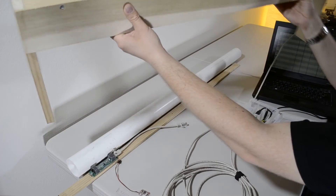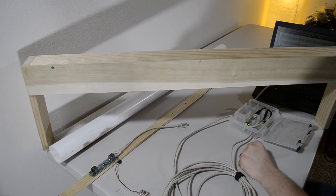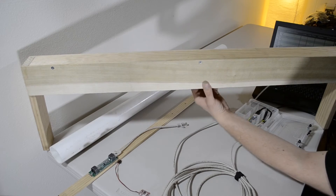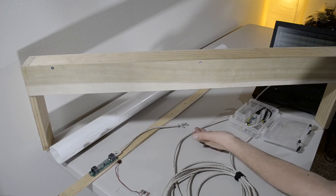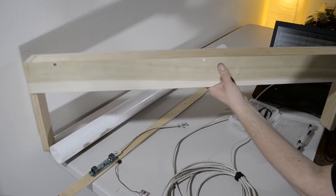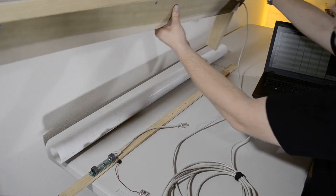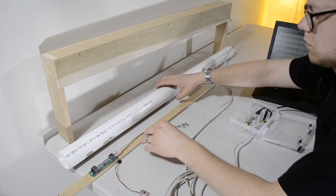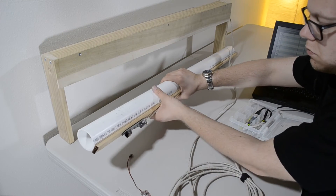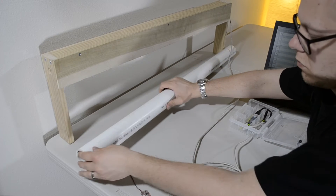You need to take special care when designing your own track bar. For a 1/24th scale track, I highly suggest developing a lap bar that only reads the light coming from directly underneath — making the bar shorter, using wider pieces of wood, and adding guard rails on the front and back, since these infrared sensors are highly sensitive. For the 1/14th scale vehicles, we used 3-inch PVC pipe and zip-tied the decoders on. I'm now making another lap bar with the infrared sensors on the inside of the PVC pipe to make it more secure.